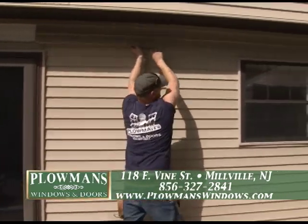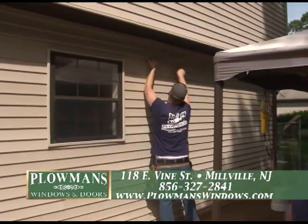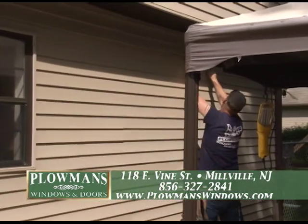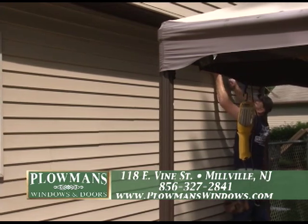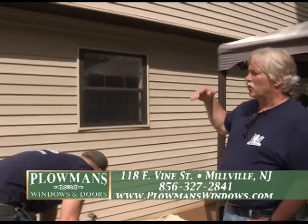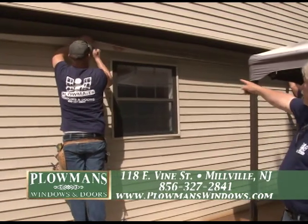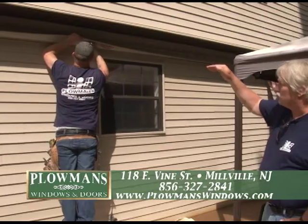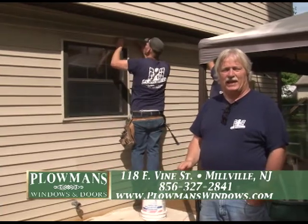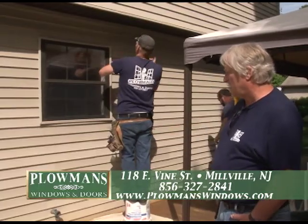What he's doing now is using the siding unlocking tool and unlocking the siding. You've got to at least unlock a row above the window in order to get the window out. When we refer to dropping the siding as we go around the house, we don't drop the whole wall unless we have to. They're going to start nailing the panels, drawing, marking, labeling — everything that comes off goes back exactly where it came from. So if you had the misfortune of having your siding misinstalled, I can't fix it unless you provide all new siding for the entire house. But if you like how it looked before, it'll look the same when it's done.